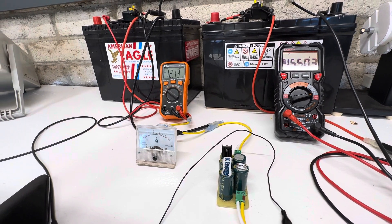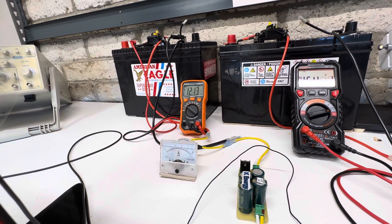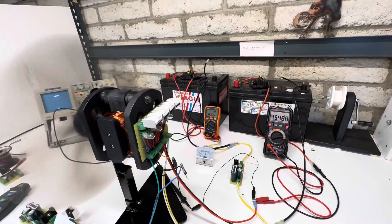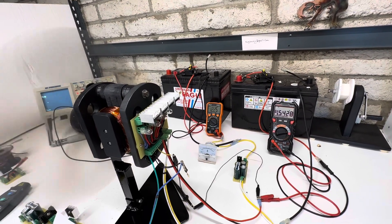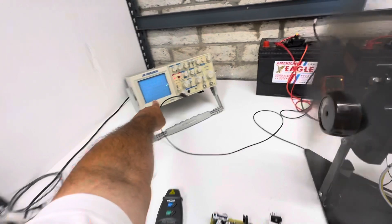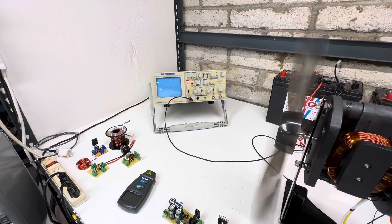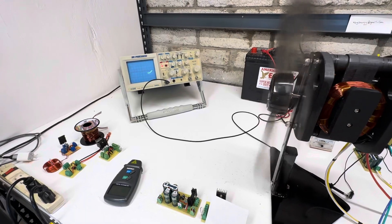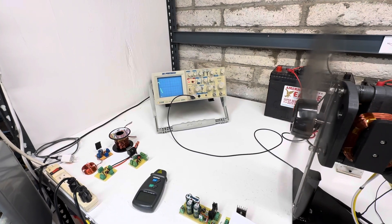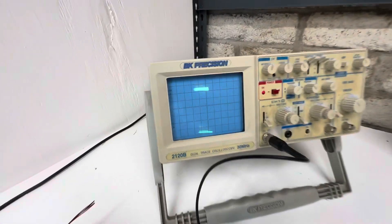We're pulsing up right around 3.5 amps, and you can see that battery charging pretty good with it — every time it pulses, it comes up quite a bit. The battery is actually down to 9.5 volts, which is not really good to do to your batteries. But when you dim it down, you can see it now — 10, 12... now you've got 30 spikes on there, 30 on and offs per revolution, versus when you turn it up. So you're getting a lot more output when you turn it down.